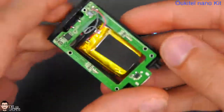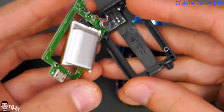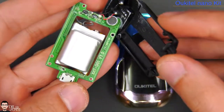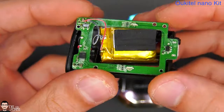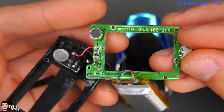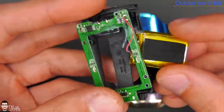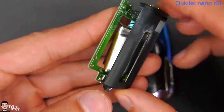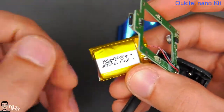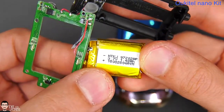At the heart of this device, there's a PCB, there's also a very tiny battery, and in my opinion a lot of wasted space. I think they could have used all this space and eliminated some of this plastic to actually provide a much bigger battery, but it is what it is. There's a very simple, very basic PCB, the LEDs on the sides, the switch that activates the device right here on this side, a few more components on this side, and there's traces of super glue all over the place. It isn't really the cleanest job I've seen, to be honest. It is actually pretty disgusting. There's super glue all over the place, and here are all the specs for the battery, even though I'm still going to measure the charging capabilities and the true capacity of the battery.